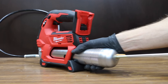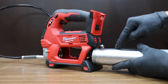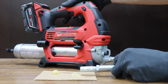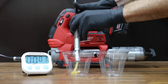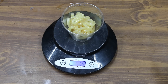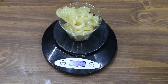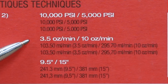To load the Milwaukee: pull back the rod and lock it, unscrew and remove the barrel, insert the cartridge open end first, and reattach the barrel. Like the DeWalt, Milwaukee provides a tight fit to prevent cross-threading. To prime, insert the battery, push the priming valve until air escapes, then pull the trigger for 10 to 20 seconds. In first gear, Milwaukee pumped 79 pumps in 30 seconds — 54 grams or 1.9 ounces. In second gear, 244 pumps — 162 grams, 5.7 ounces, or 11.4 ounces per minute. Milwaukee beat its advertised specs in both gears.